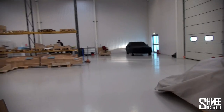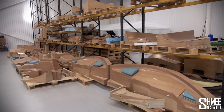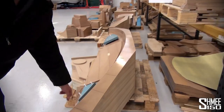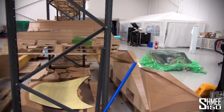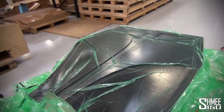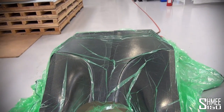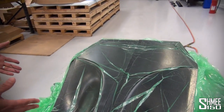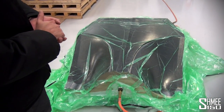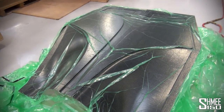Let's take a quick peek in the other side — this is where we do all our composite work. Absolutely everything to do with the AF8 is made from 109 mouldings. Some are carbon moulds, some are blue Chemi-Block system, some are wood-based. Here's an engine cover — the butterfly engine cover you saw — just being prepared. This first stage is called debulk, where you put one layer of carbon down, leave it for a time period, take the bag off, then put down five more layers of carbon and a filler system. It's carbon-reinforced plastic — layers of plastic in the middle and carbon on either side — which keeps the weight and cost down.